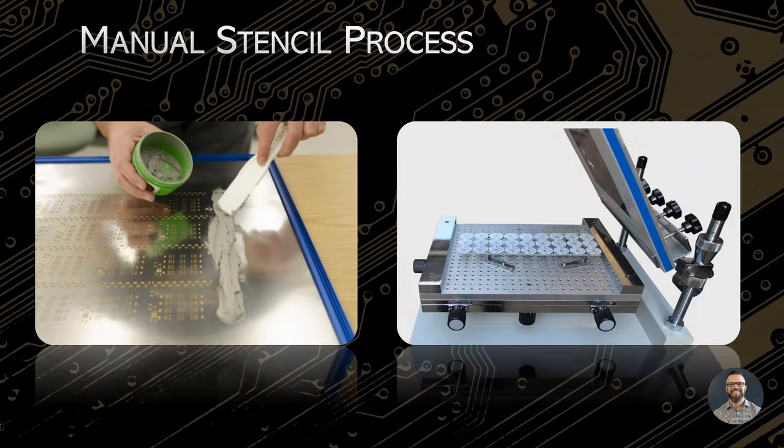When you start using machines to run the squeegees, do the boards drop down or do the stencils lift up? In the picture on the right side, there's a large frame below with the board mounted, and on top you can see a clamshell top cover — that's where the stencil actually sits. You can see the white circles of the board, and they close that clamshell lid, which gives you a flush surface. Then you apply the paste.